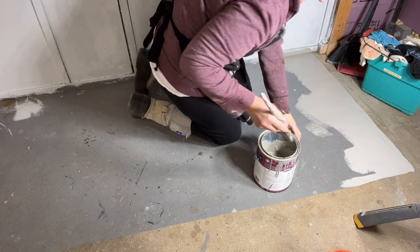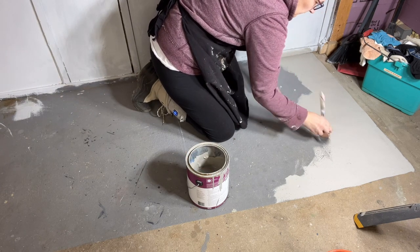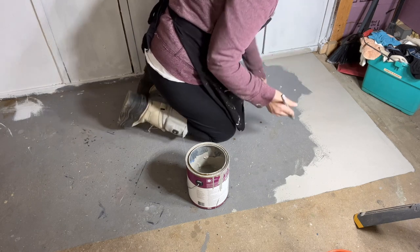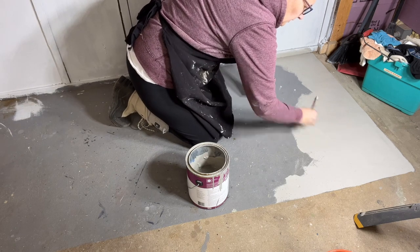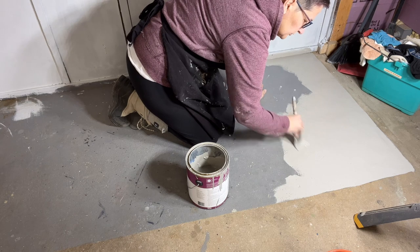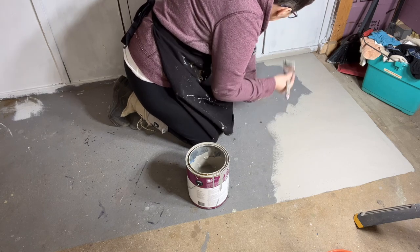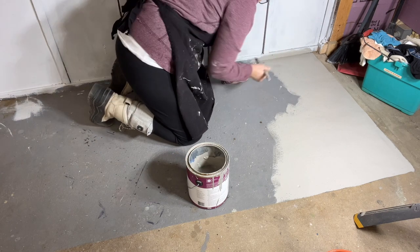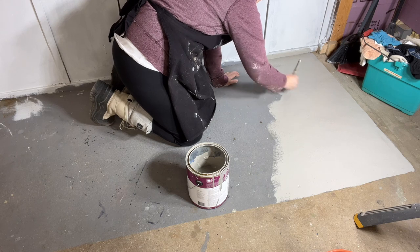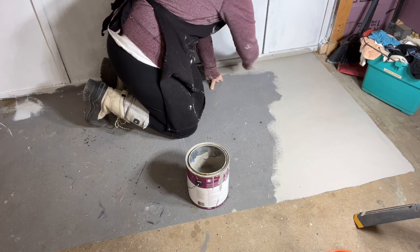I just want to fill in the dimples in the floor. If you don't want your brush to get screwed up, don't use your favorite brush on the floor — always save a junky one. After your favorite brush starts to get worn out, losing shape, and the bristles aren't behaving even if you wrap it up after cleaning, save it for jobs like this. I can feel a big draft right here from the bottom. I need to get some spray foam cans and fill up all the cracks, because heating outside in New England is not very smart.